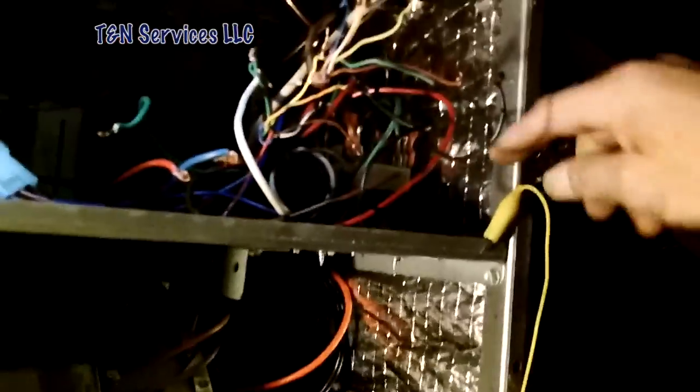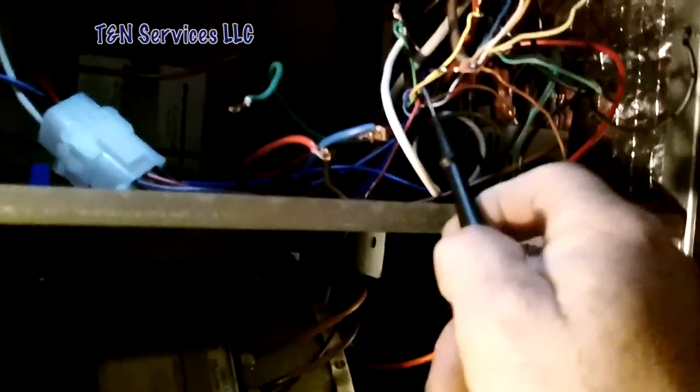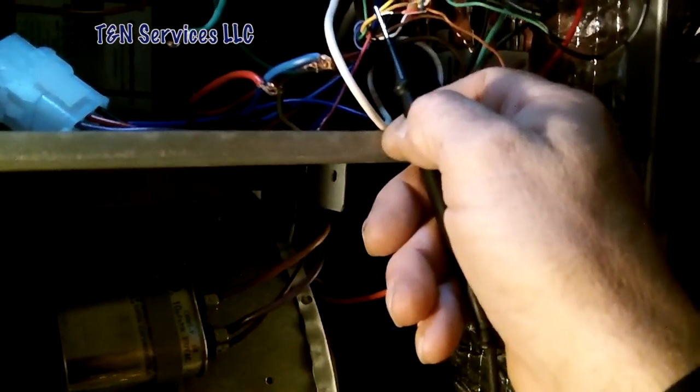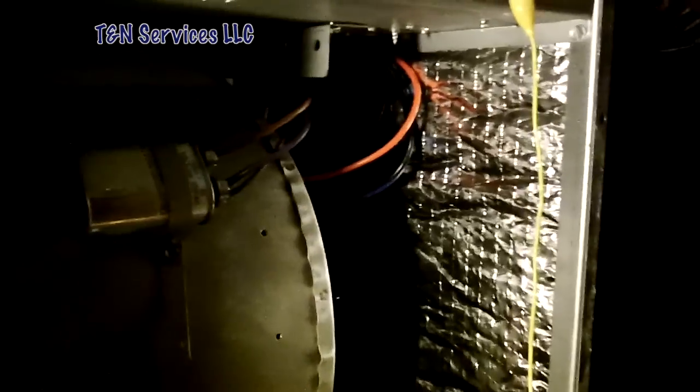You would think since those two were touching — let's go ahead and check the brown and the red and see what happened. Got my jumper attached to the brown, turned the meter back on, and they short out together. But they weren't when I was here before, or I wouldn't have connected the brown. Something's happened — I don't know if we got a rodent or something. He can chew on this wire all he wants from here on out, because it'll be dead.